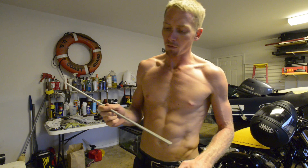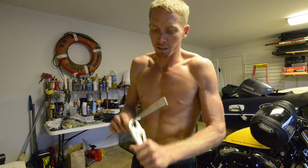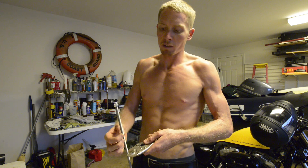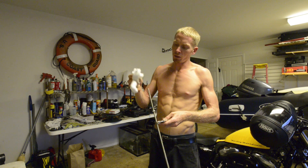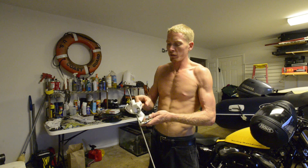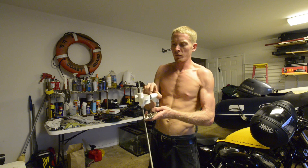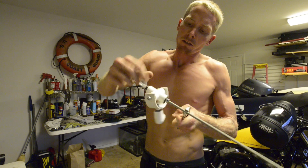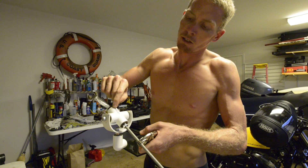After cutting that piece off, get a pair of vise grips — you're going to need to hold onto these nice and tight. The nut's going to go on here, and we're going to bring it down about 5 inches or so. Now take our steadicam assembly that we already made and slide that down. Make sure it's nice and free to move. Now we're looking at another axis — so we've got this one, this one, and this one. Looking pretty good. Tighten this nylon nut down, but don't tighten it too much — this PVC is pretty fragile; you can actually see I've already cracked it. That's from not sanding enough.